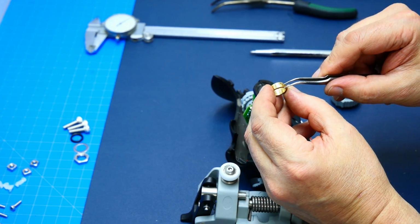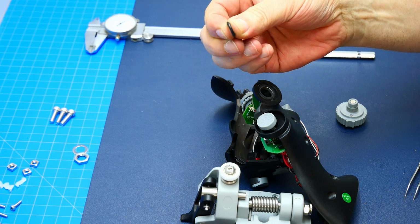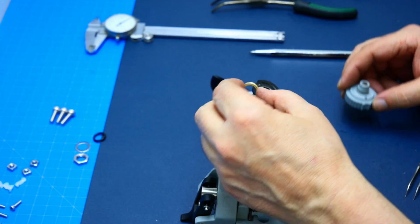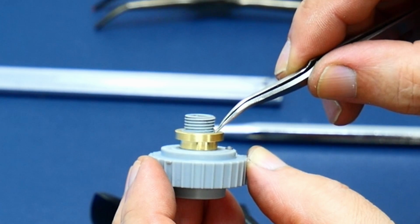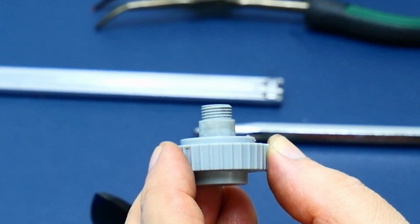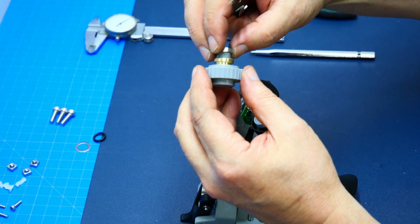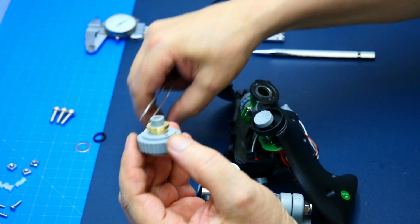Now this side here makes up from the inside with that stupid bubble-gummed Buna O-ring and a washer. So we don't need any of those, certainly not the O-ring. And once this is in, you can see that right now if I put it in, there's just about 0.1 between that thread and the knob shaft. So that means when the knob is inserted and turns, there's enough of a step down for the washer not to rub on it, but not enough to make it wobble.